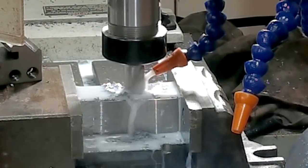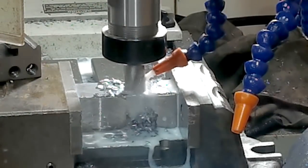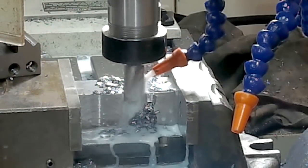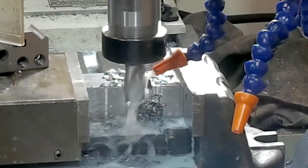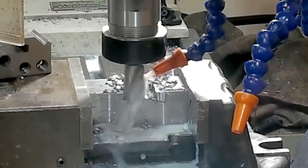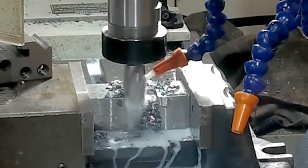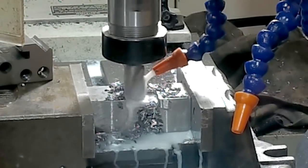Then I got on with the tool slot. The tool I'm using is a 4-flute carbide cutter, 16mm diameter. I'm cutting at a depth of about 6mm and a feed rate of about 20mm per minute estimated. The tool speed is running at 400 rpm.